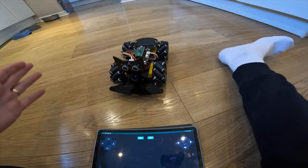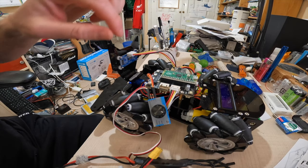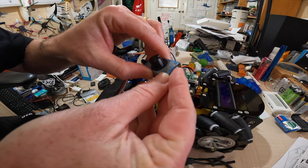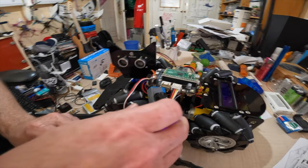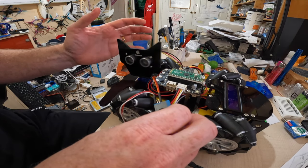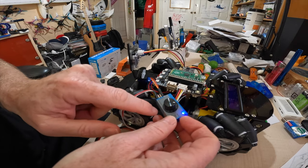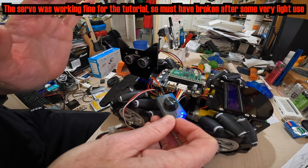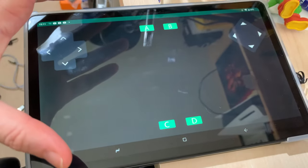I find the app slightly disappointing — things are missing. Why can't you do proportional movement? Why can't you combine movements so the robot could sweep around? It's a lot better than the infrared remote but it doesn't do everything. I checked the servo with a servo tester — on neutral it should re-centre, but even on five volts it's doing exactly the same crazy behaviour. It doesn't like the signal it's getting. It's knackered.